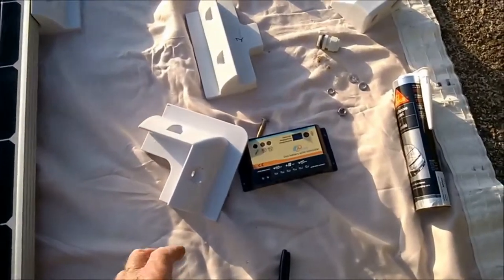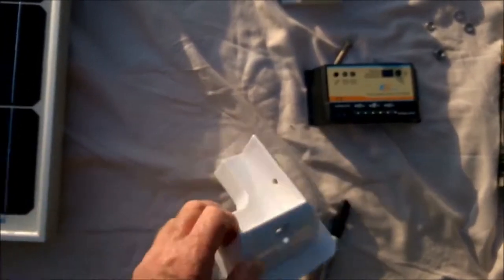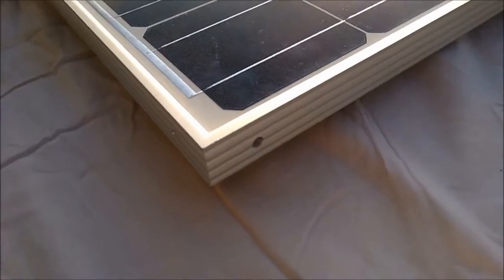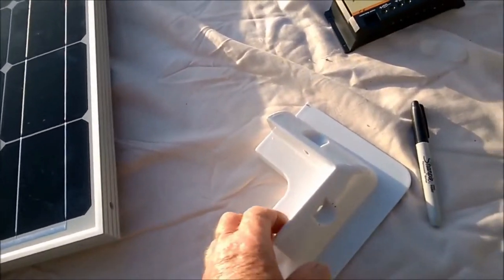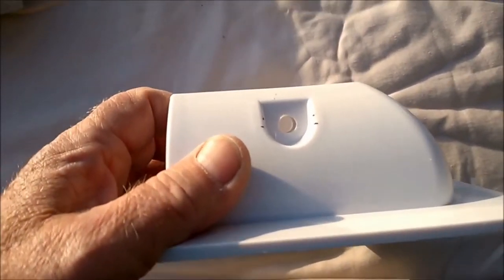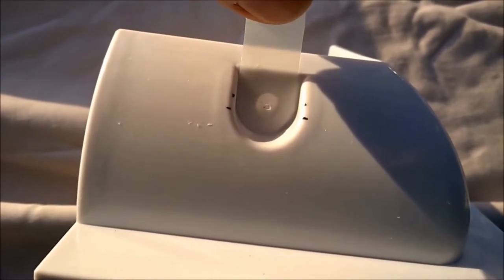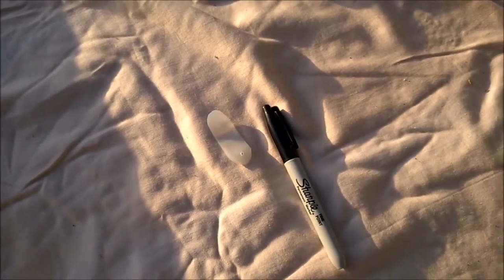The brackets come as a pack of four. The hole you can see there is not pre-drilled — I've drilled that hole. What I did was first make sure that when I drilled the hole through the side panels — the aluminium there — I had plenty of room to put the nuts on the other side without fouling the underside of the panel, and then measured that onto the corner bracket so I was in the right place. To make my life easier I cut out of a milk carton a little template, put it on each of the other brackets, and just used a Sharpie pen to mark through the hole on each bracket — so you've got all your holes marked up ready.